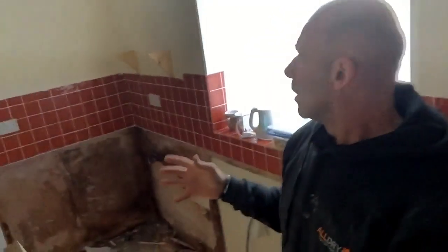If it's on a chimney breast and it's up at height, nine times out of ten it's going to be a sulfate salt, so it's going to be absorbing moisture from the air. You've got condensation season, so most properties are quite humid. You don't open your windows as much. The air outside is humid, so it just adds up.